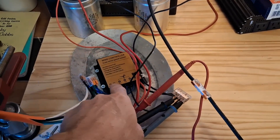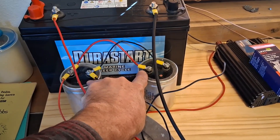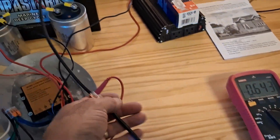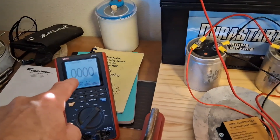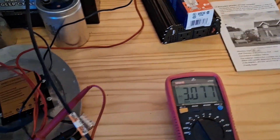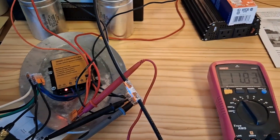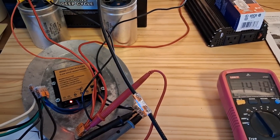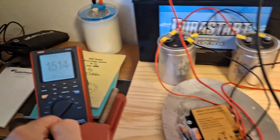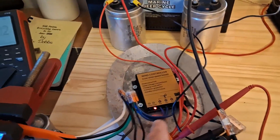Current will come from the wind turbine — the brake is on right now so everything is off — and go into the wind controller. It's not regulating anything yet, but what it'll do is charge up these capacitors first. When the capacitors reach the right amount of voltage the light will come on on the wind controller, and then it's going to be sending current through this diode into the battery. Right now we have zero current going into it. I'm going to put the switch on so the wind turbine comes on. The light just came on — the controller is on now and we are charging: 1.6, 1.1 amps — so we've got current flowing into the battery and everything is still working.